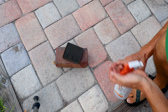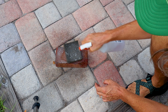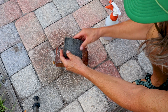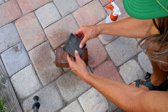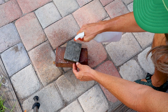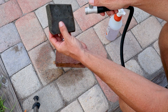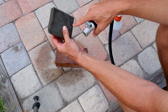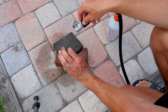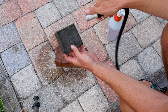Cleaning up this air filter — the manual says clean it with a mild solution. I'm using a very watered-down mix of Purple Power degreaser. This stuff is actually pretty good; I've used it on air filters for machinery in the military. Just don't make it too strong. Another thing with these is you don't want to wring them out — we're gonna let that chemical sit on there and do the work, then rinse it out nice and gently with the hose and let it dry. When rinsing, pick a direction and go with it. You can see by the impressions here this was the engine side, so there's some oil. I'd rather push oil deeper than push dust in, and any oil that gets deeper just adds to the filtration effect until it gets clogged — fine balance there.